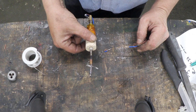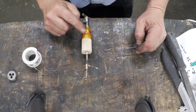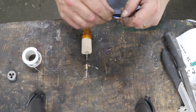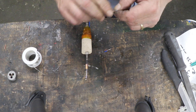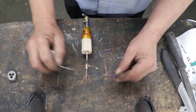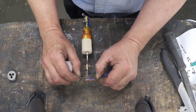So here's my portable battery-controlled soldering iron. I've put a bit of Kapton tape on there — that's good up to 400 degrees centigrade. It's on four volts, so just a four-volt current going through, and it's surprising how low this will work. It heats up extraordinarily quickly at six volts, and my four volts is enough to solder those two bits of wire together.